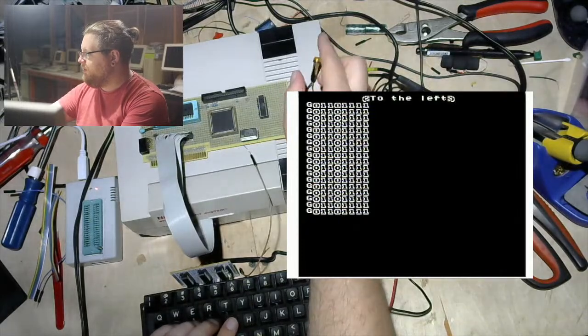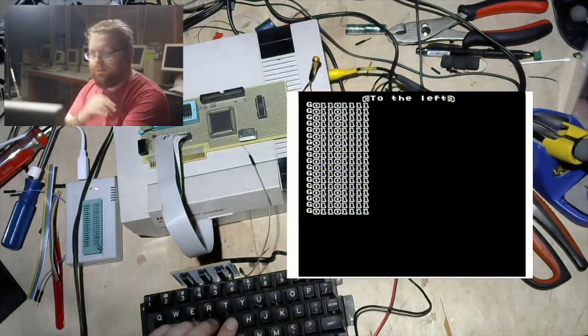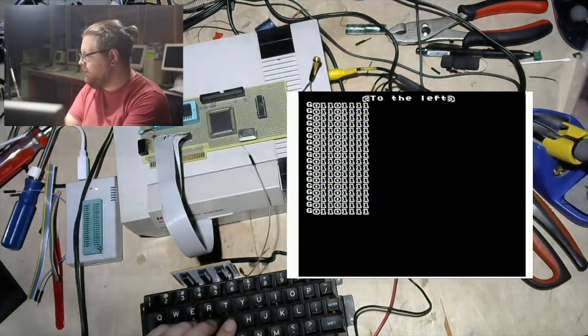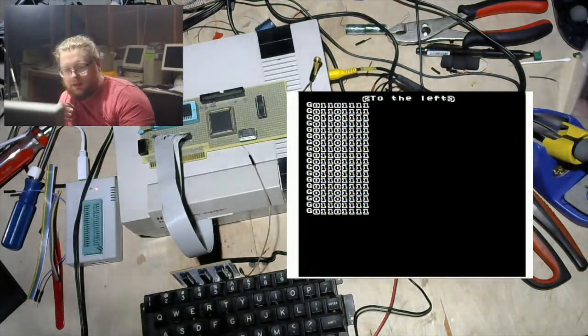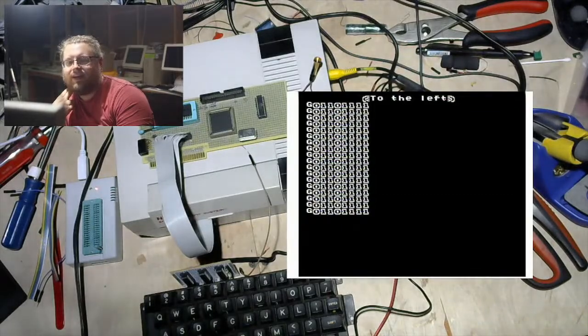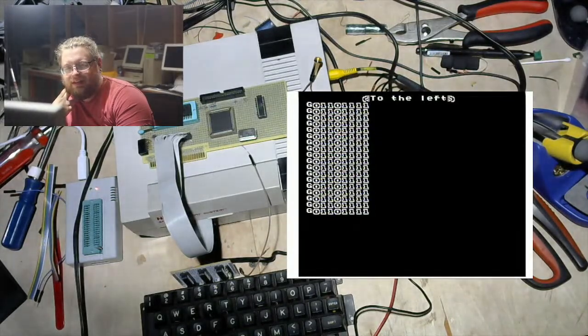I guess one thing I could check is, it's not the data pin at this point, because I'm flopping FFs to it, so it should be flipping on and off, because I am exclusive ORing the thing. Let me scan really quick to see if there is an obvious way that I am screwing that up. So I push a 0 onto the stack, and then I pull it, XOR it with a literal FF, and then store it and push it back onto the stack. So yeah, that should be alternating.